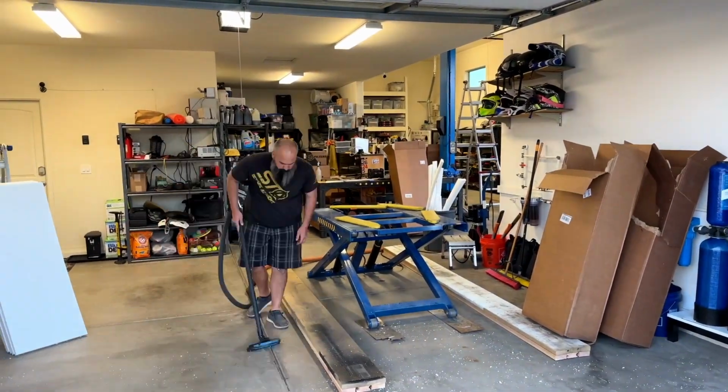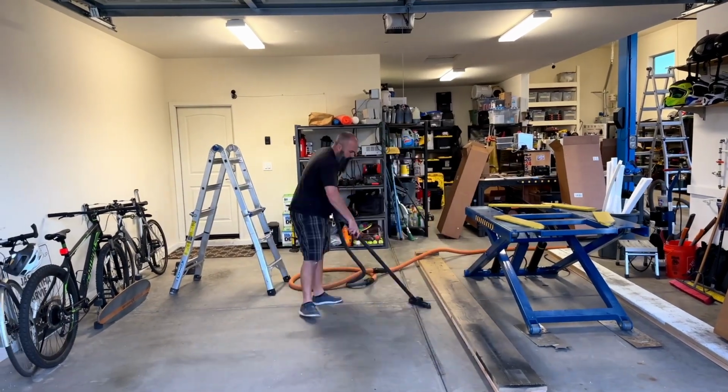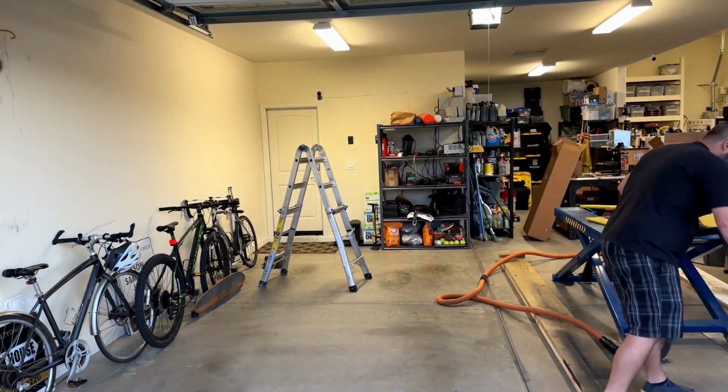All right, that's another project on the books, and I'm getting that much closer to having my garage ready for air conditioning. I can tell you after 3 years here in the Phoenix Valley, it gets very warm out here. The first year, there was no insulation in the attic, in the walls, or in the doors, and it was ambient temperature or more in the garage all the time, which totally sucked. I insulated the ceilings to about R30, and that dropped it about 20 degrees overall. Still into the low 100-degree temps when it was 120 plus outside, not cool.